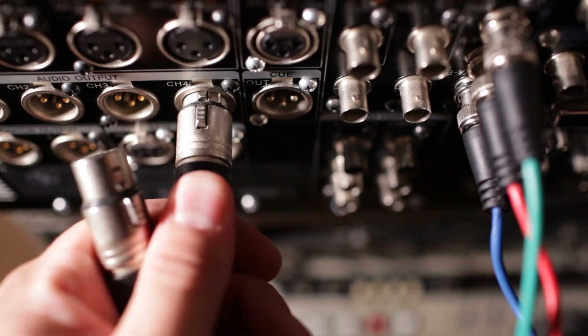Or even if you're just a veteran DJ like me who likes to have tons of controllers around — what you will find on some of the less expensive controllers is that they might not have XLR inputs and outputs. In the sound and DJ industry, when you're working big events, mostly everyone uses XLRs because they're supposed to be a better quality type of audio. It's not that RCA is worse, but where you may run into some obstacles is if you are trying to plug into a speaker that doesn't have RCA inputs. So this is your RCA.